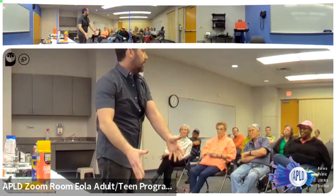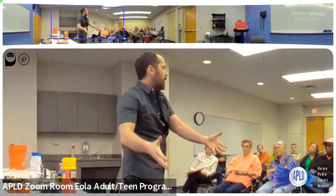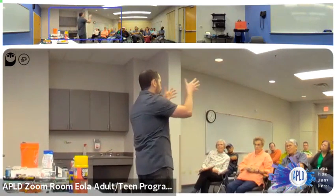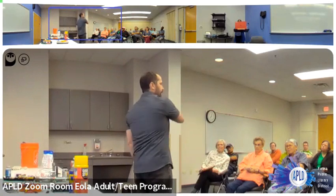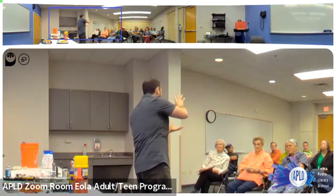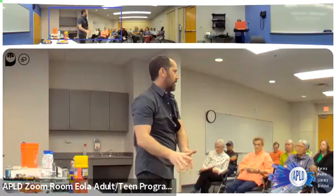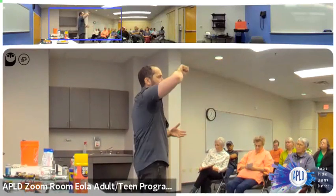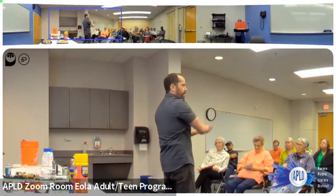Take the square. You don't have to get it perfect. It can have a little bit of a trapezoidal shape or whatever, right? Just make sure it's bigger than the hole. Put this on the wall, trace and cut nice, simple edges and put that in. So instead of trying to match some irregular, weird shape, just work with the shape that's easy to function with. Put that on the wall, cut the hole bigger. It also is gonna give you nice edges. Now you just cut clean lines, whereas what happened is the bowling ball got thrown through the wall, right?